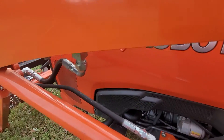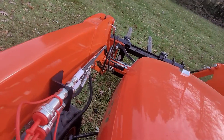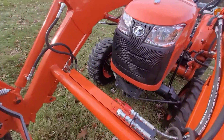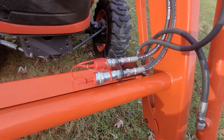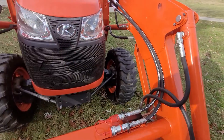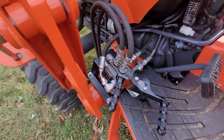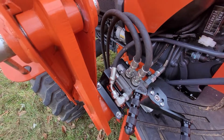They connect up here at the loader arm. This mount is very secure. The hoses are routed very cleanly along the loader arm and then terminate here for your outlets. All of this is going to be sub-assembled for very easy installation. This whole hose set right here will be mounted with the brackets and everything. The valve will be mounted to the mounting plate that I've designed. You'll probably just have to mount the foot pedal and attach this whole assembly to your loader mount and run your lines over to the other side.